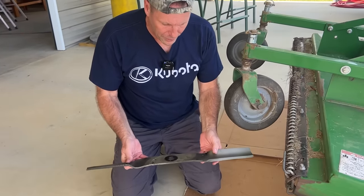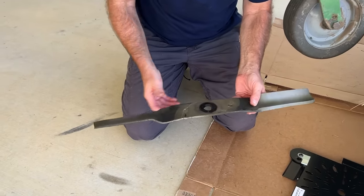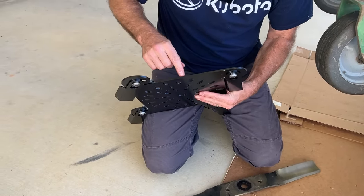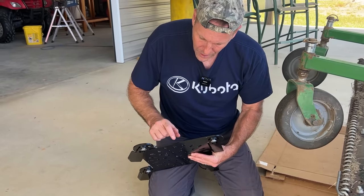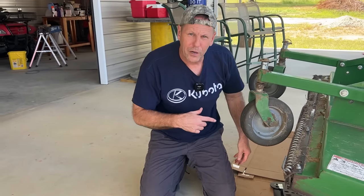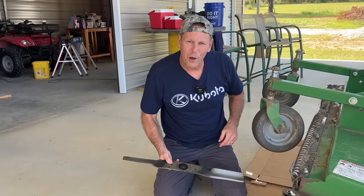This shows a difference compared to the traditional blade. This is a fairly new blade — we just bought it this season. We've mowed probably 15 acres with it and sharpened it three times. But the thickness of this traditional blade is thicker than the Cutlass blade, and that's why we had to shim out our spindle — the bolt wouldn't tighten because the land on the spindle was too long. But with those shims, it tightened up fine. We've got the first blade on and we're going to go ahead and put on the other two blades, then we'll go back into the pasture and compare the two mowing strips.